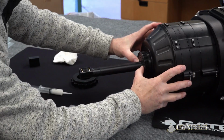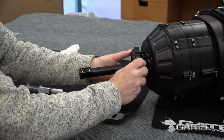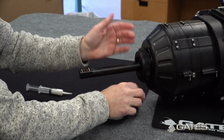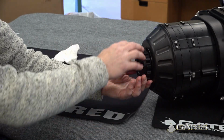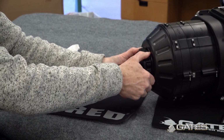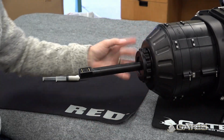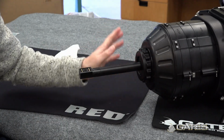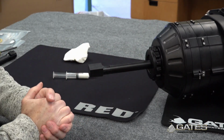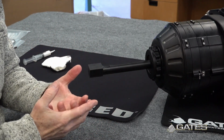Okay, I've got my split rings in place. The last thing now is my locking collar, the threaded locking collar, which I'll bring over and find where the threads begin. Tighten that in. And now when it goes loose until it seats onto the split rings, when it does that, you want to go just a little bit further, and then you're done. It's going to come to a stop, and you're done. The cone is now sealed around the barrel, which is exactly what we want. Okay, put my protective cover back onto the PeriProbe now. That is the steps involved in setting up the PeriProbe.